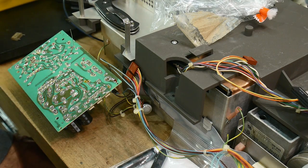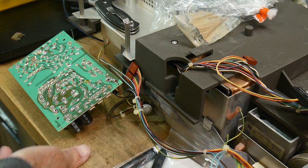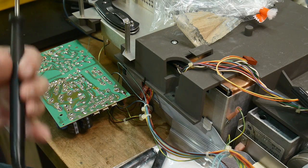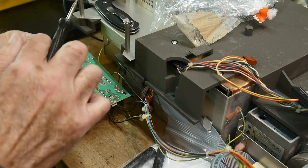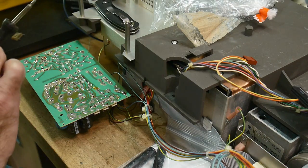And yeah, let me heat up my soldering iron. I know everybody's jealous of my soldering iron. Heats up in about, I don't know, 15 seconds. Doesn't take long. Doesn't work like a normal soldering iron. It has 13 megahertz of RF coming up this cable, and the RF comes into the tip, and then the RF gets turned into heat here at the tip. So yeah, it's already hot. All right.